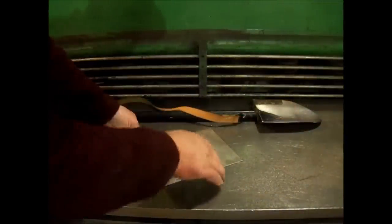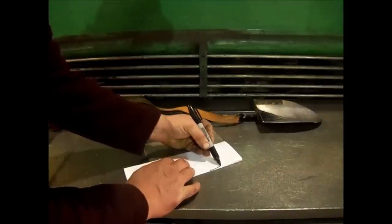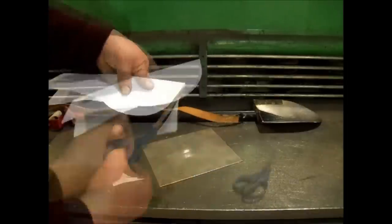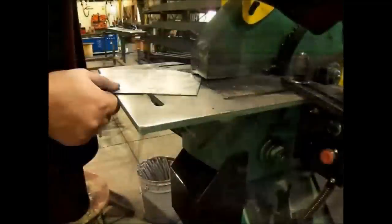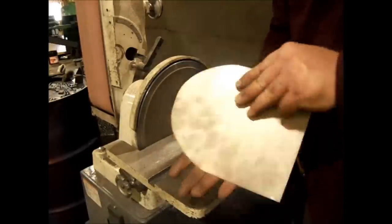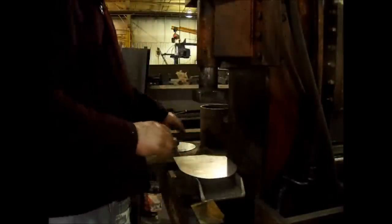Just get a piece of paper the width of the steel that you cut and fold it in half. Just trace what you believe would be a nice shovel tip — keep it curved and keep it going smooth. When you open it up, you have your blade end. We now have the rough cut. Let's go to the sander. What you're going to end up with is a nice, smooth profile. So let's go ahead and put the concave in. We have the plate for the blade to the shovel sitting on this channel. We'll take a 7¼-inch pipe and put it on the center of this plate.